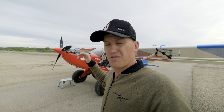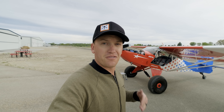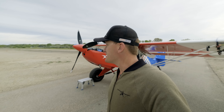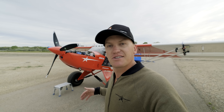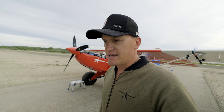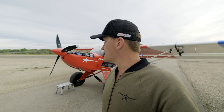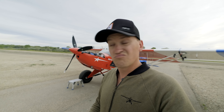I will say I'm impressed with the takeoff performance. I was worried because this thing's about four inches smaller in diameter than my old prop — I went from a 79 down to a 75 — and I thought I was going to be lacking something on takeoff. But because it's constant speed, I can use all the RPM and get up to full boost, full manifold pressure, make more horsepower. Also with it being constant speed I can go a lot faster if I'm willing to burn the fuel. Yesterday when I was testing — and mind you I'm not up high — down here at 3,000 feet I think I saw 124 miles an hour true, which is pretty fast for a draggy Kit Fox with big tires and big wings. I'm impressed.